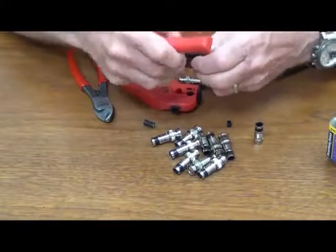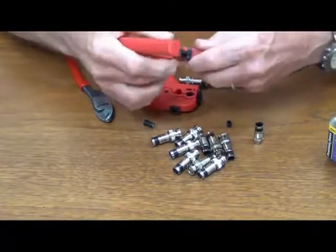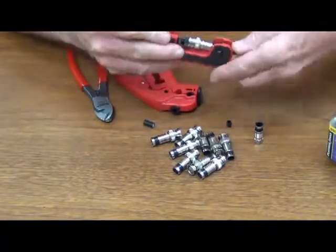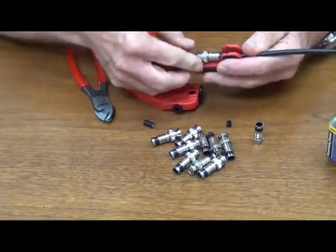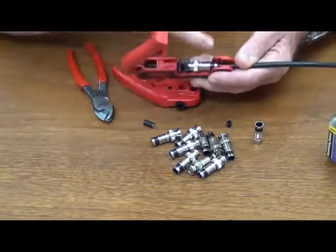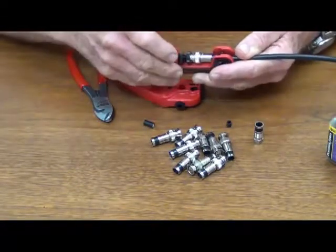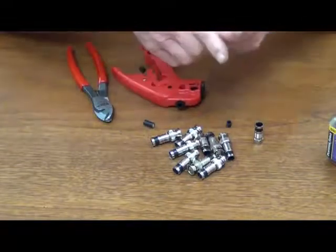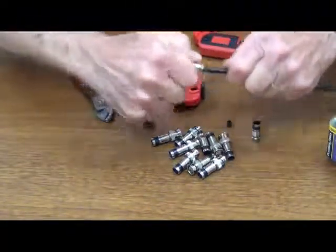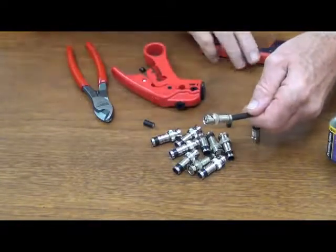This one's going to have to be adjusted. I'm going to unlock my nut — I know I'm going to have to go down quite a bit probably. You can see it's a little longer. I need to keep turning it until I'm about equal spacing of what I'm going to crimp and what I see between the end of the connector and the base of the tool. So that's about right there. And then I'm going to crimp it — we're done. SealSmart connectors, BNC, RG6. Thanks.